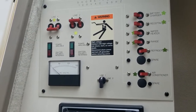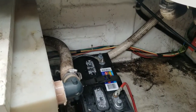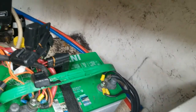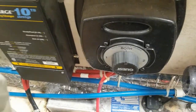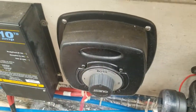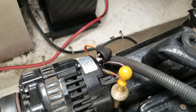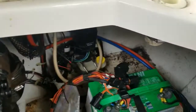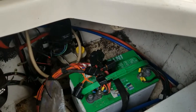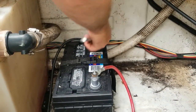Let's take it to the bilge. There are a lot of ways to do this — you've got a negative over there you can unhook, and negatives over here, or you can turn the battery switch to the off mode. The problem is we don't know that it shuts everything off, because the bilge pump stays hot even when the battery switch is off. That orange lead is always hot on this alternator, so we are going to unhook the ground wires. Be careful not to touch your wrench across two terminals.